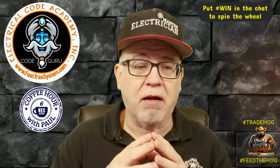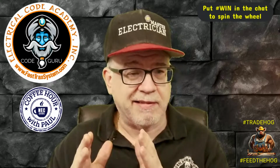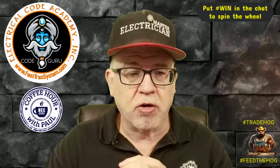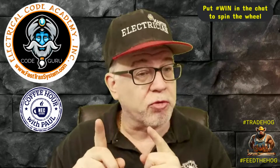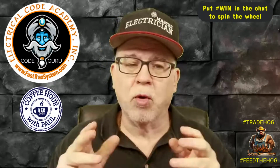Now, why do we parallel? We parallel because we're trying to get more ampacity. We're not paralleling equipment grounds because of that. Okay, the code just says what we do. They connect them all together in a parallel nature. But when we parallel ungrounded conductors and grounded conductors, and we say grounded, we're also talking neutrals in most cases. Not all cases, but most cases. We're paralleling in order to get more capacity.